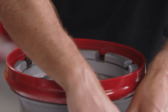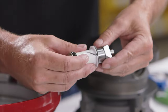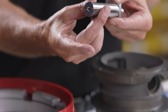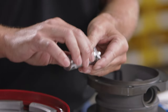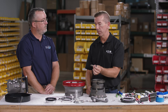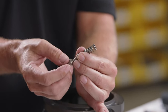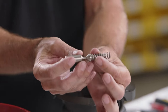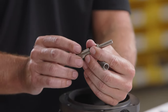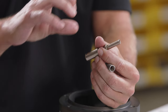Also check the crankshaft — it uses Teflon seals for rotational movement to prevent metal-on-metal contact, so inspect the surfaces for scratches or gouges. Inspect the detent pin as well — it is exposed to the environment and can accumulate dirt and debris. Remove the spring, check the surfaces, and use fine emery cloth to smooth any pitting or corrosion for smooth reinstalled operation.